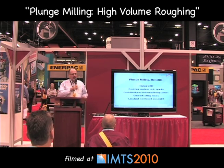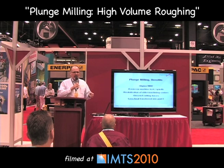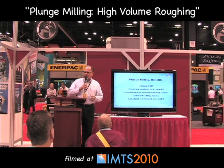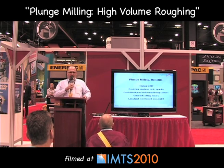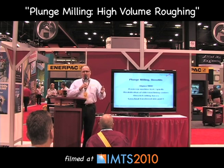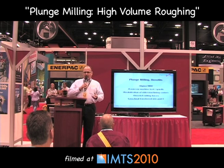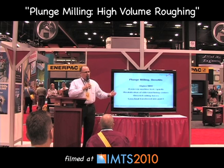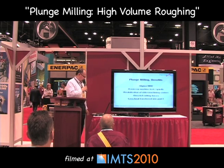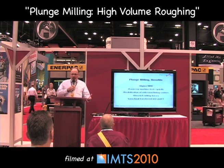Many times people will take an older machine that was really past its prime, not capable of keeping up with high speed or high feed machining — and by the way, that's a relative term. So if you're doing a process with a zero degree lead tool and you're getting only 15 or 20 inches per minute of feed rate, perhaps 10 or 12 cubic inches per minute — not a terribly efficient operation. But you can take that same machine, retrofit it so it's precise with a good solid spindle, and now be very productive because you're putting everything in an axial load. The directed cutting force going up into the spindle is key.